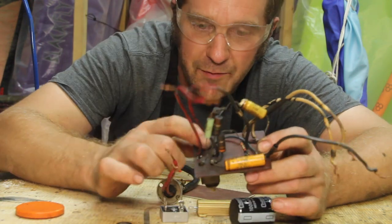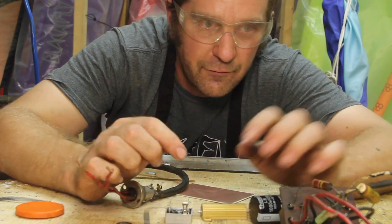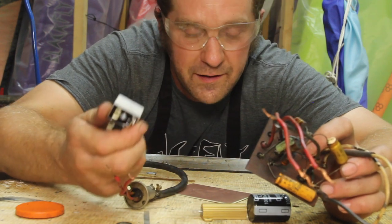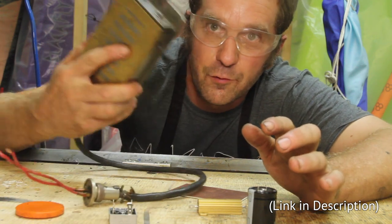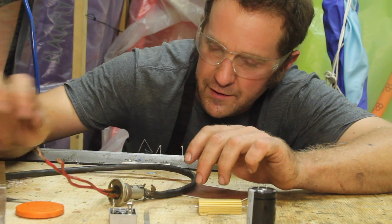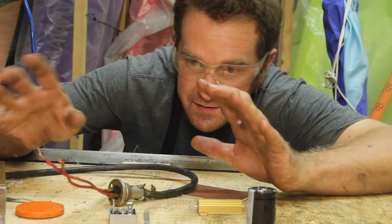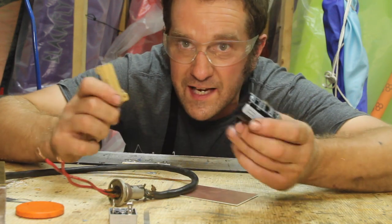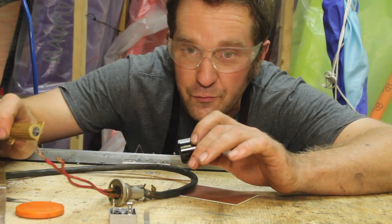In this video, I'm going to replace this with this. Going from a half-wave rectifier to a bridge rectifier, full-wave rectifier. The plans I'm using for this I found specifically for this mag chuck for the Sanford SG48 surface grinder. I don't know how it applies to other mag chucks, if you need to make one, how you size the components. I'm just going off of what I found that I know works for this one.